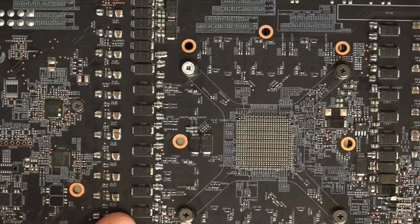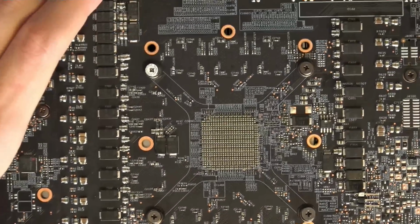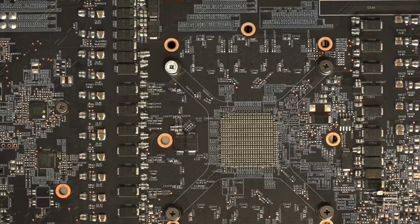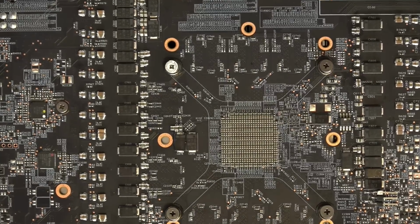They're 0603 package size. They're awesome because 0603s are small, high capacitance, and convenient to just jam sort of anywhere, which is why I've gone ahead and put so many of them on the card. They just fit really well. You don't really have to worry. If there's a little gap, you could probably put one. But anyway, so I added a bunch of those.